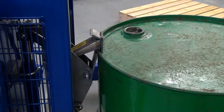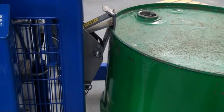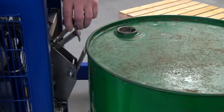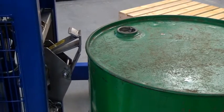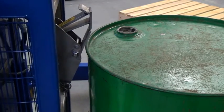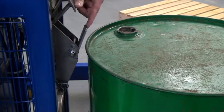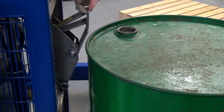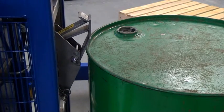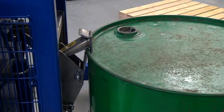I'll demonstrate the lift now — nice, good connection. Next, let's look at what happens if the height is wrong. If we raise to a higher position and try to connect, you can see the toggle isn't below the lip and the top hook hasn't hooked over the drum. All we need to do is press the lower button — you can see the rack coming down, the bottom toggle goes under, and we're ready to lift.